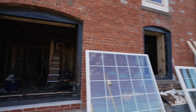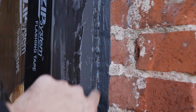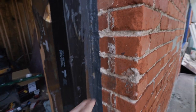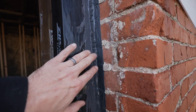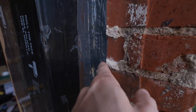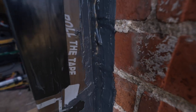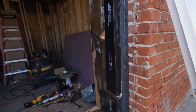It is Tuesday November 1st and as of yesterday I've got both of these windows pretty much sealed up. I had to cover them up to let the liquid flash dry overnight, but you can see how it adds a pretty good thick layer between the framing and the brick. When it dries it's still a little tacky — this stuff is taking longer to dry than I expected — but when it does dry it has a kind of rubbery feel to it, which is definitely nice and I have no doubt it's going to do the job well. There are a few spots where when it dried, some small holes showed up where the brick or wood underneath is showing through, so I'll go back and cover up those few spots before putting the windows back in.